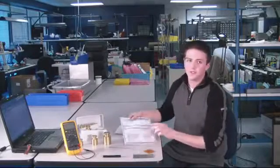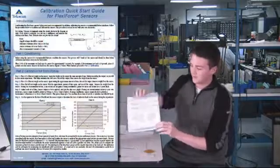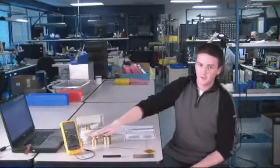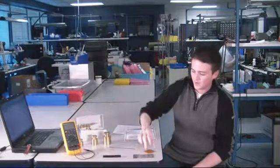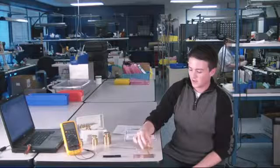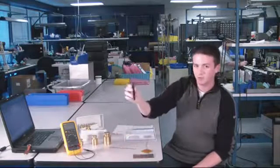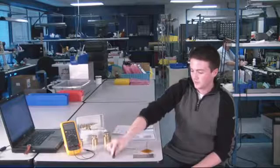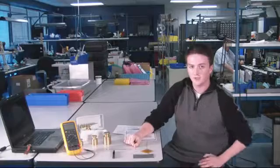To do a calibration, you will need our QuickStart Calibration Guide, available on our website, a set of calibration weights, a multimeter to measure the resistance output of the sensor, and a material to use as a puck on the sensor, which you can punch out with a mechanic's punch tool. We will discuss the necessary reasons and the construction of the pucks later.